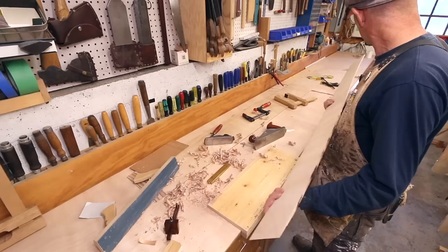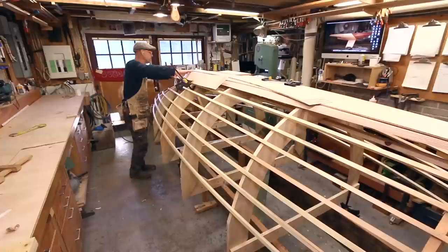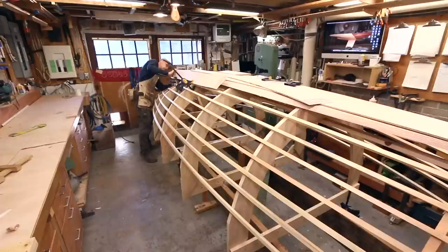Okay, so this guy is ready to go onto the boat. So let's go on the boat like that. The thing about this now is I just gotta make sure that this is overhanging my rib band a tiny little bit. I've given myself about an eighth of an inch of slop. The only place that this is a bit critical is right at the hood end back here where I've taken it to the finished line, so I'll just line that up.